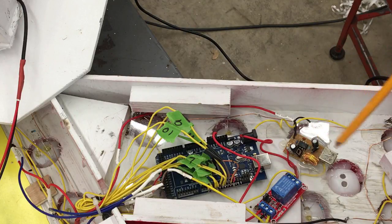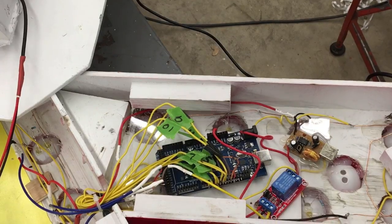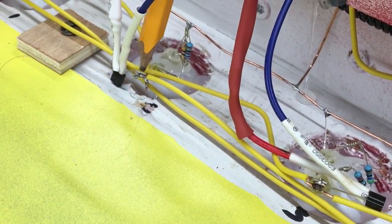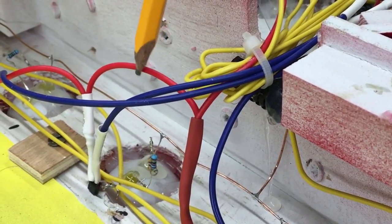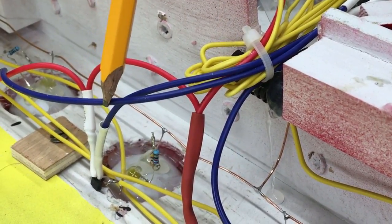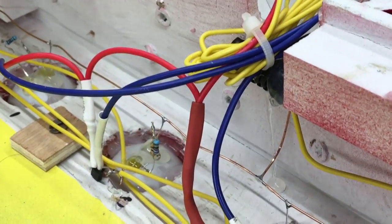Then I had to use a transistor with those. I could have used more solenoids, but they're very loud. Right here we have a transistor, there's another transistor over here, and there's a third one way back over here. The power comes in here — this is the main power to those. And these are the blue wires that trigger each transistor. These blue wires go straight to the Arduino, and when they get a signal from the Arduino, they will then send power to the outside chase lights.